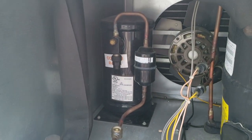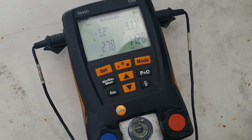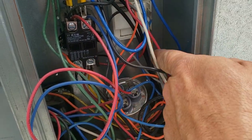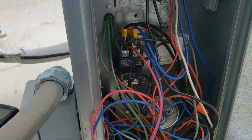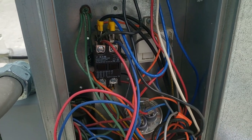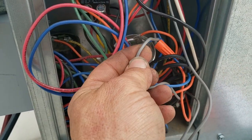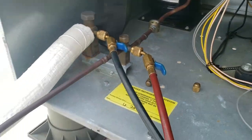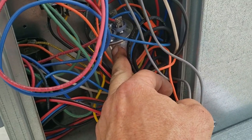One of the pressure switches is tripped - either the high or the low. I just checked voltage on the coil from my contactor and it is not receiving voltage. There's the gray wire going to the low pressure switch coming off one of the legs of power. Coming down there, coming back - I can see one power leg. Need to find the high - the high is the yellow one. I'm not overly impressed with the capacitor as it is.